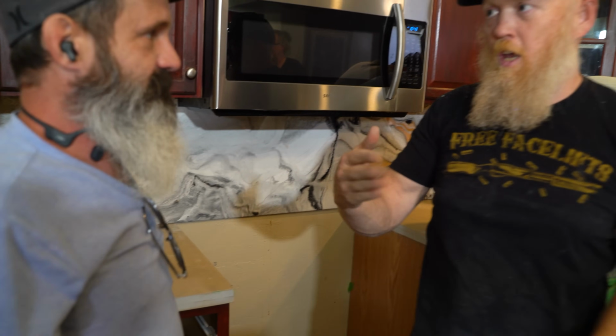Now if you have a really uneven wall, that silicone will stick to the wall and then pull back out. And as it cures, it becomes a really stiff shim. It cures there, but it'll keep it. That back wall was so wavy, and now we'll silicone it like that and leave the sheet just perfectly straight.